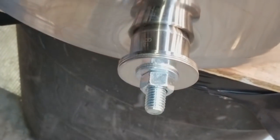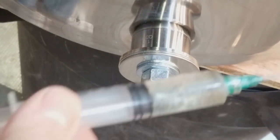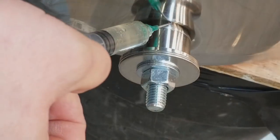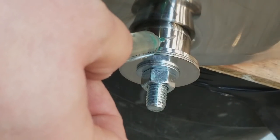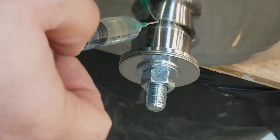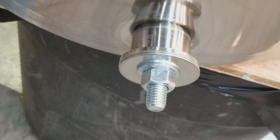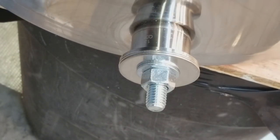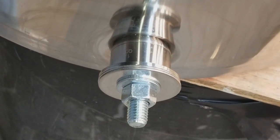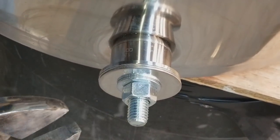Right about here is where I like to grab my flux. I keep flux in a syringe with a blunt tip, and that lets you squeeze some flux in here — on the ferrule itself as well as the leading edge. That's going to lubricate as it comes in and also ensure there's a lot of flux in that really fine gap you're creating. I didn't actually put the flux on for this demonstration because I'm not going to finish the soldering today — I didn't want the flux sitting on the surface that long.